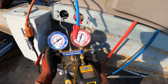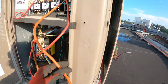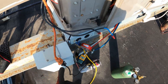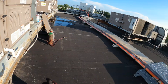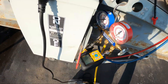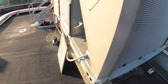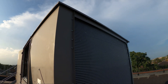I'm going to open all our valves. What I did here was I actually stole power from here so I can get power — making a separate video on this, it's going to come out after this one, make sure to check that out. This is an awesome trick of the trade when there's no power source on the roof or you don't have an extension cord long enough. Once this nitrogen is fully out and our gauge is reading zero, we're going to start our vacuum. Putting the covers back on while it's pulling a vacuum. The vacuum holds and it's time to charge this baby up.